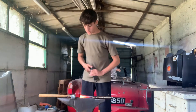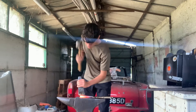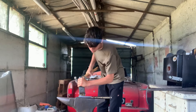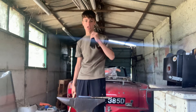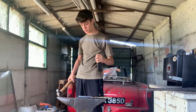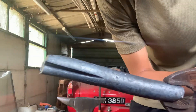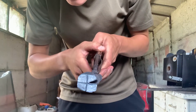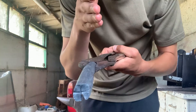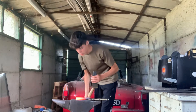I'll cut until I'm right next to the middle of that cross on the top. I'll bring this out and carry on — if it gets off I'll tuck my chisel and try and guide it back towards the middle. I've cut down there to where I want it to be, now I'm going to come from the other side and meet in the middle.